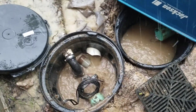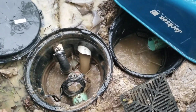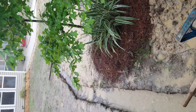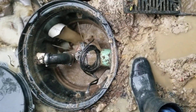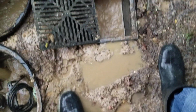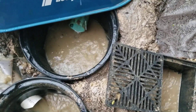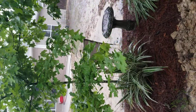This is the new setup in the middle of a rainstorm. Got the double barrel tanks, got a French drain coming in on this white pipe right here — that goes all the way up there and around my patio where all those rocks are. I got this blue pipe which is another French drain: 90-degree elbow, 12-inch catch basin, then it turns into a French drain all along the back of the property and then along the fence right there. Then this tank right here with that blue pipe — that is a gutter downspout which comes from that gutter in the corner if you can see through the trees.